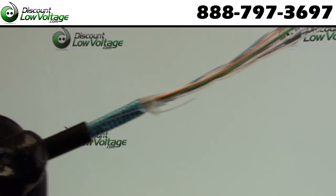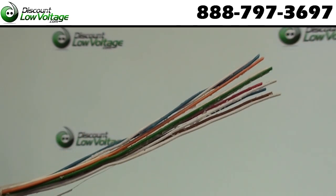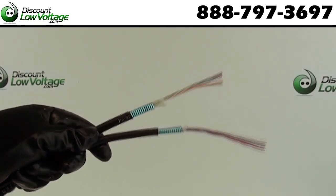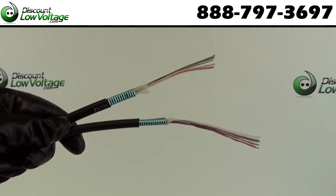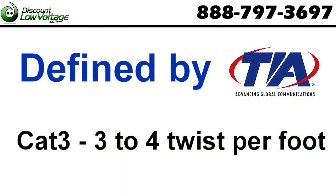Under the shield you have a core tape. That core tape needs to be three and seven eighths of an inch to the end of your copper conductors. Now cat three cable has a light twist — you may want to cut a little bit more off the jacket at first just to keep your pairs separated.